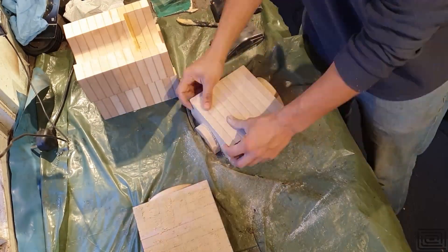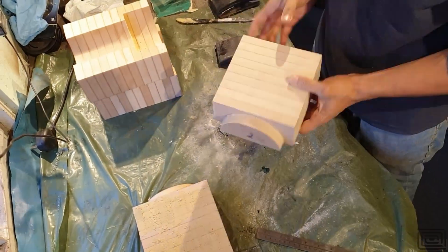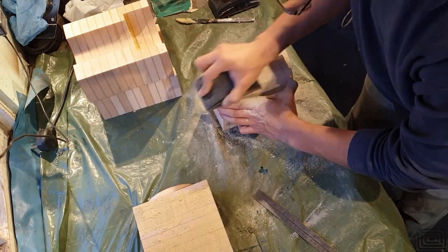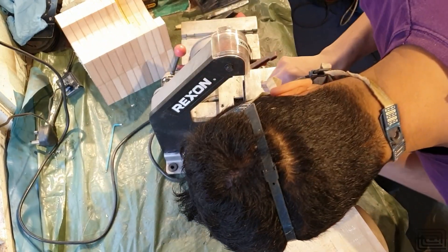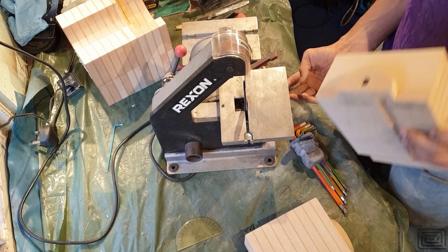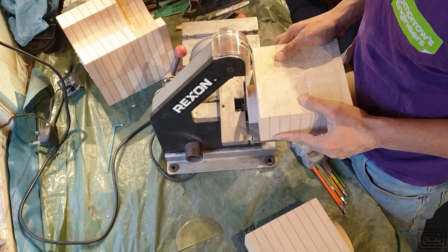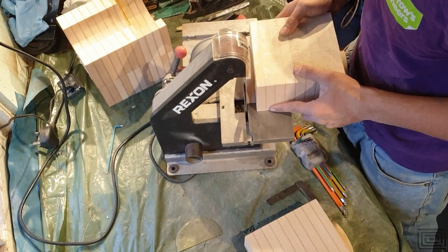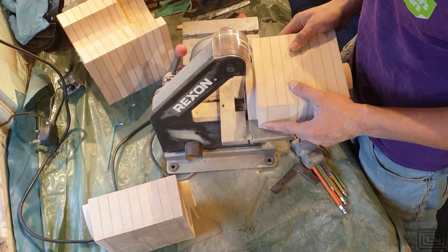I'm doing some sanding with about 120 grit sandpaper. Most segments came out okay but some areas had quite a lot of chatter, so I filled those in with some two-part wood filler. I need to fix the chatter problems — part of it was because of a long cutter and another part was my angle or contact bearing setup. Over here I've got the belt sander and I'm sanding a 2 degree taper on the ends where the core sits, to help pull the pattern out of the sand mould.